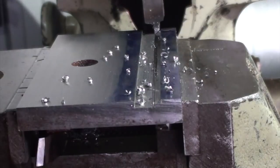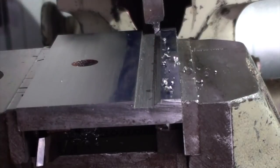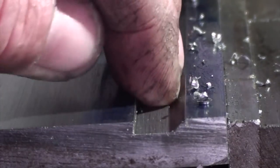Okay, little update on where I'm up to. I did have a little bit of trouble trying to shape a tool. As you can probably see, I've got a square on this side, and this side over here, I have to re-grind the tool and just take out that edge. I'll go down a little bit deeper yet, because I really want a positive fit for the slide there, for the jig. When I make the jig up, I really want a nice deep groove, so there's no chance of it slipping out while I'm grinding the tool, and I think it'll just make a better job of it. So that's where we're up to.